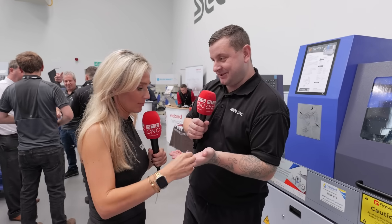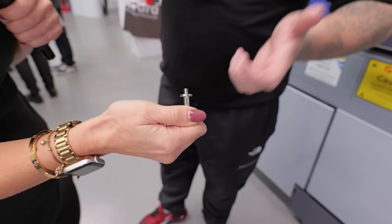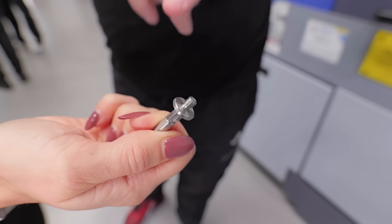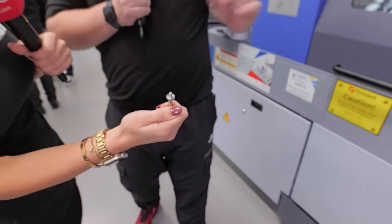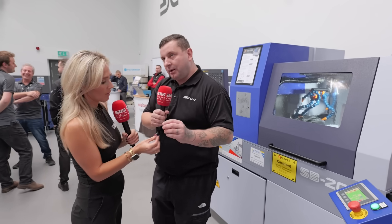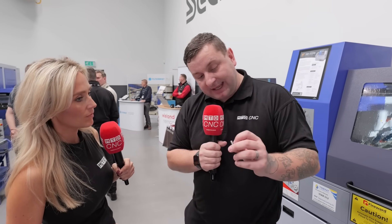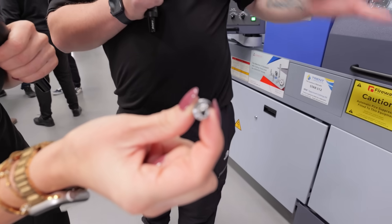We're going to start on the SB20R2, which is making what we'll call a pin — but it's not just a pin. The keyways are really small and the thread is tiny. Getting that thread perfect on thousands and thousands of parts will always be a challenge because it's quite a fine thread. And when this is made from 316 stainless, which is quite a stringy material, getting an M3 or M4 thread all the way down that shaft is no small feat. It's showing what the machine can do.